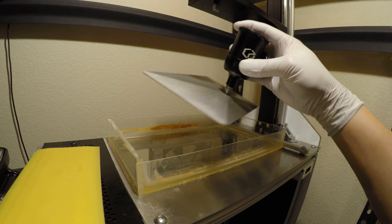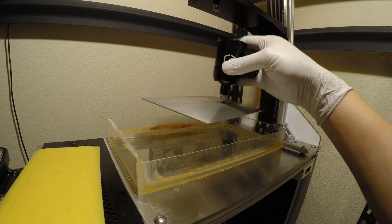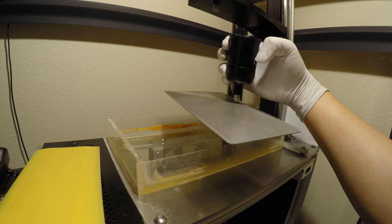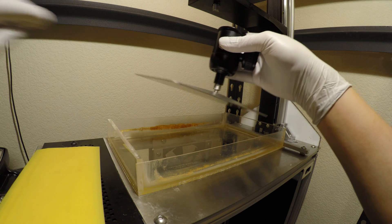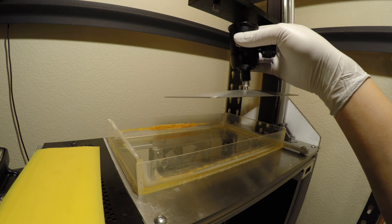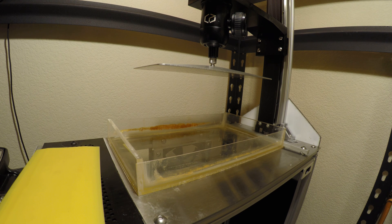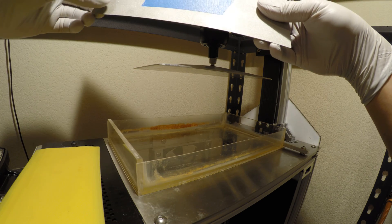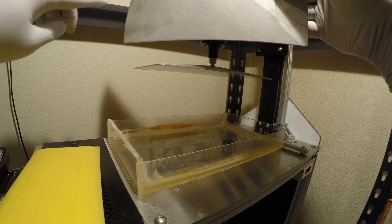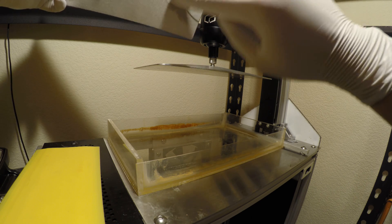I am using a custom-made build plate designed by T. Dixon 1000. He posted some very nice 2D diagrams and machining instructions. I converted it into 3D and had it CNC milled, because my manual milling skills are pretty poor. I attempted to make one to his spec on a manual milling machine, but I got a whole bunch of deflection which created extra marks.